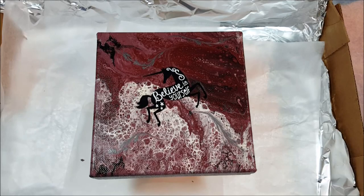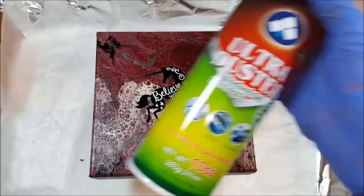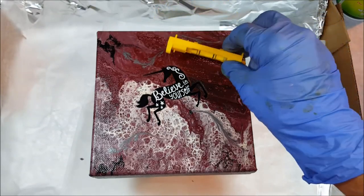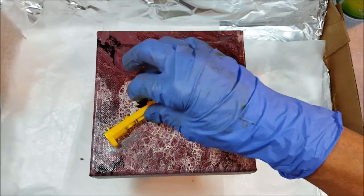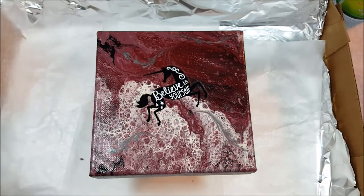And before I paint anything, even glazing or painting, I use this, one of my little tricks, to get the dust off certain things and even around the bins. And then I wait a second for the other dust to settle before I even get started again. And when you're glazing, not painting, but glazing, you should have a level to make sure that all the edges are level. And I've already checked this once before, because you can't just check one spot. You really should move it around, because with that glaze, you want it to be spread out and even and not too thick in a corner or whatever.